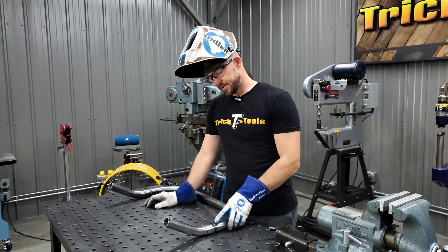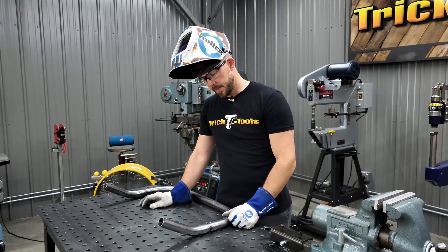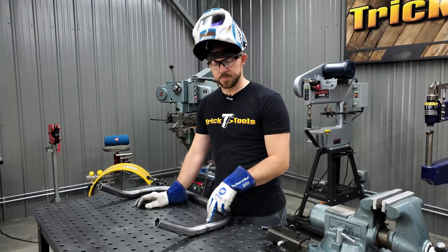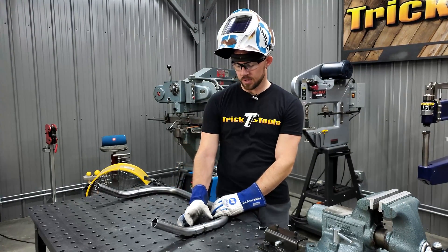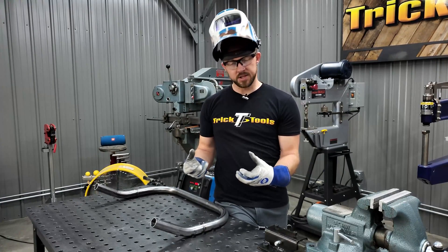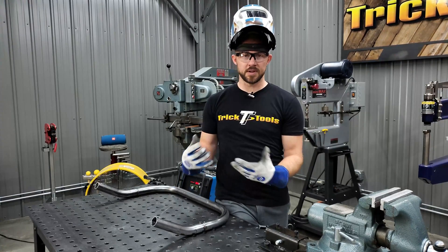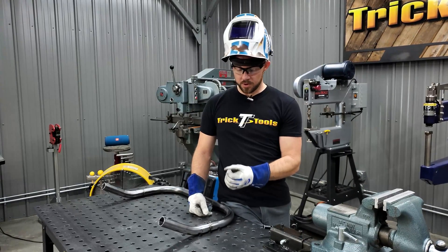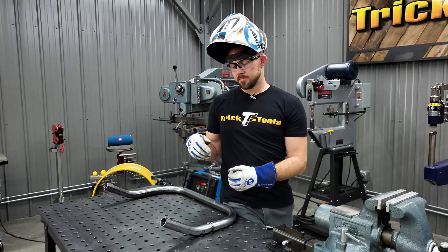The first thing I'm going to do on these joints is fill in the plug welds on either side of the butt weld seam. How I approach plug welds on tubing - especially on a slip joint like this - is to make sure everything has the extra strength required, so the tube itself has as much of its original strength as possible. With a plug weld you have that round hole, and I'm TIG welding these.